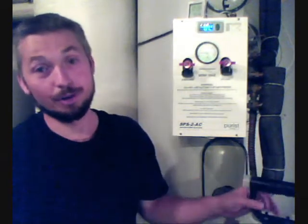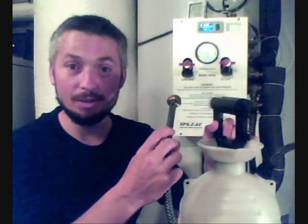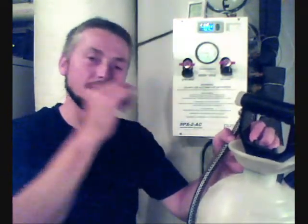The other way, without having an expensive charge pump, is using a simple garden sprayer. I have one here — this is what I use to top up my system. I went to Home Depot and bought a $15–$20 two-gallon sprayer tank, took off the nozzle, and put on a female hose barb. I fill it up and hook it up to the drain side, which is prior to the check valve. With the air vent at the top, I pump the charge tank filled with glycol and it goes up both ways to the roof while the air comes out the top. By the time I'm starting to pressurize the system, there's very little air in it. When the pump turns on and circulates, any remaining air bubbles get trapped in the scoop and go out through the air vent. It works out very well.